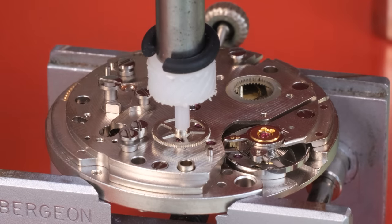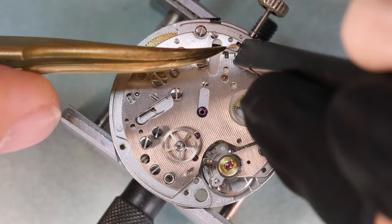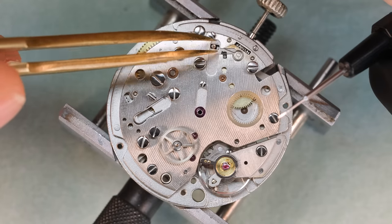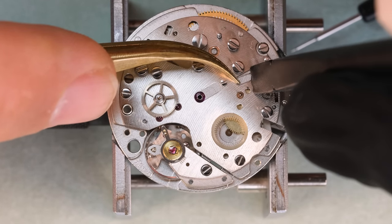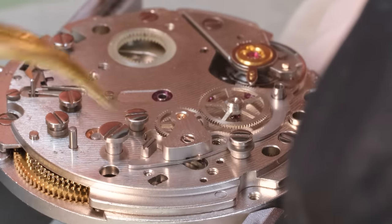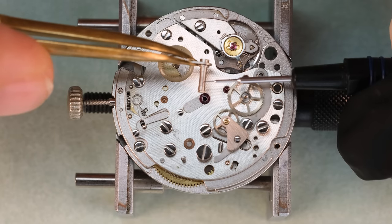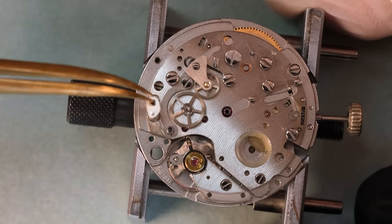That's something we relatively often see with these old movements — after a thorough cleaning and lubrication they run very nicely again. It's a testament to the quality of these movements. Lemania is a legendary maker of chronographs; they were their own company until the 1980s but were in a consortium with Omega and Tissot since the 1930s, and thus made most of the chronograph movements for both those companies. They also made some watches under their own branding. Some might recognize this movement as the Omega 1041 — it's the exact same movement, just typically with copper plating.